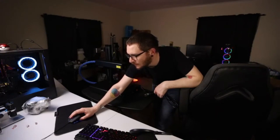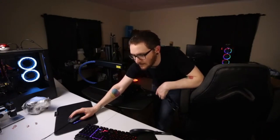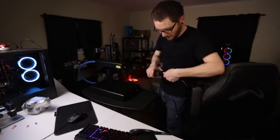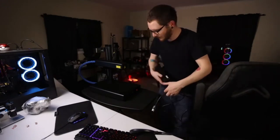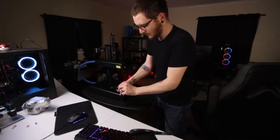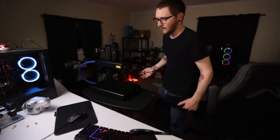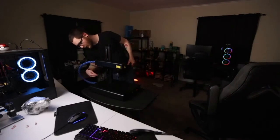I'm sure that it's fine for you, Mark. If you think that it's working well for you, then it's not a bad decision. The best laser is the one that works for you, which is what I've always said. If this is the only thing in your budget, then that's fine. You don't have an option at that point. But if you have a bigger budget than this, I wouldn't start here, because it's just not going to offer some of the other capabilities that a larger machine is going to afford you. You can't use really the super large lenses with it. 25 watts just isn't enough power to drive a 200 millimeter lens. It's just not. However you want to spin it.